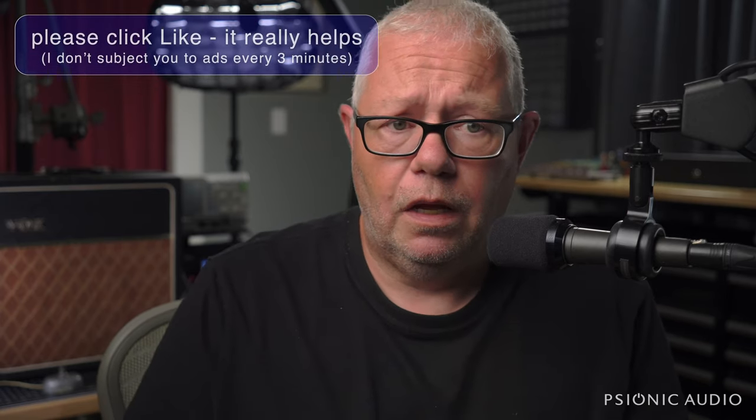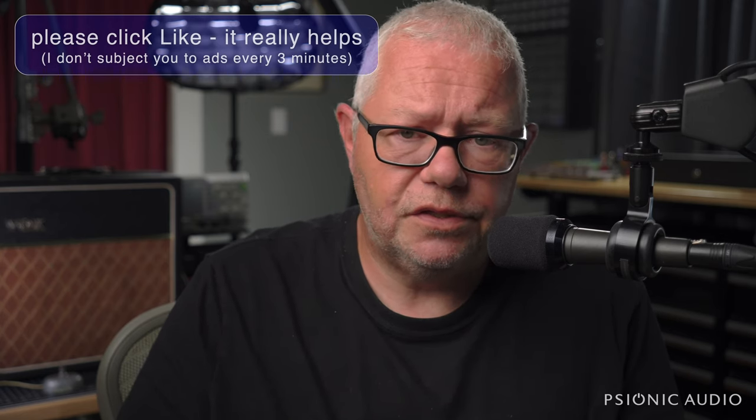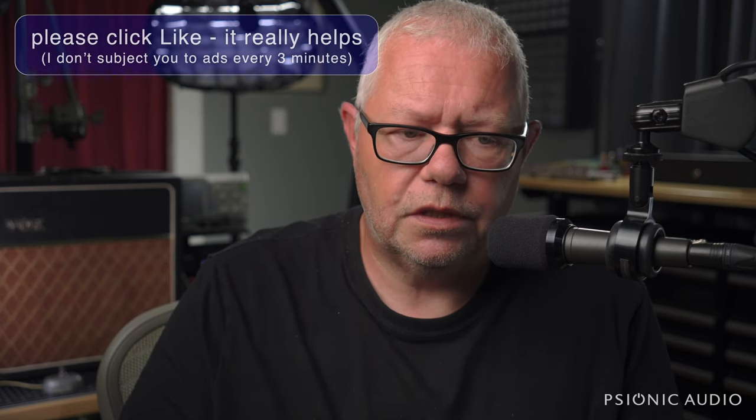I have not modified a Marshall Lead 12. I don't know that, given the current value of Marshall Lead 12s, whether I should modify them. There are a lot of things I could do. Don't change the pots in a solid state circuit because other Marshalls or other Fenders don't use those value pots. It's a solid state circuit. Everything's totally different about how everything is approached as far as impedances go and what role those pots are playing in the circuit. You don't want to put in there the values you'd find in a Super Lead just because it's a Marshall.